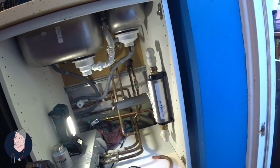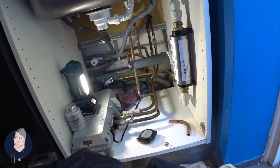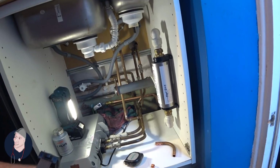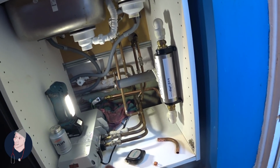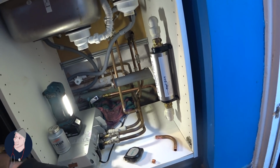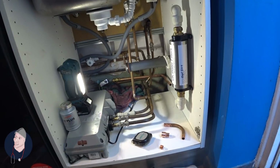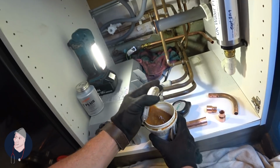It's a very large filter. This is a small flat, and it's designed for a 3-bed house. 22 mil feeds. That's something else. Anyway, it's UK made, which is good. It looks all stainless steel. The customer should be able to change this. Would I? Not so sure. I'm not going to put a bypass on it because it just isn't the space.